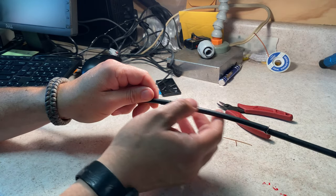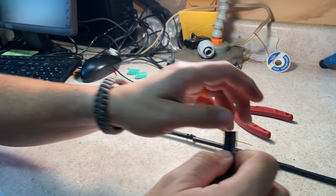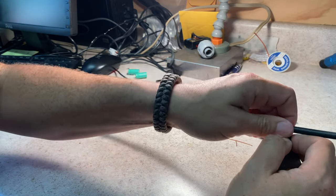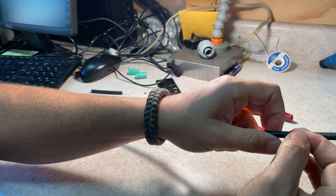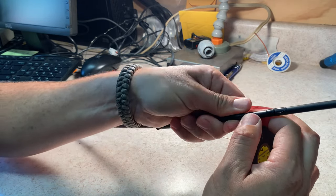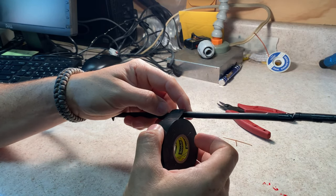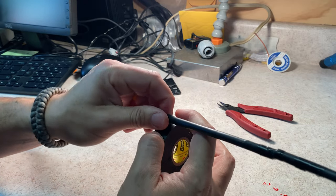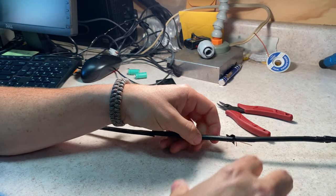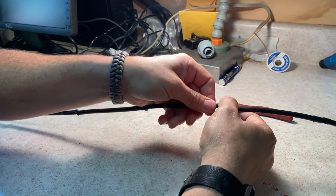And then we have all these bits of electrical tape insulating. So any place where I trimmed wire sticking out of the jacket, I'm going to put a piece of electrical tape on. And then at all these junctions, I'm going to put a piece of electrical tape. This electrical tape at the junctions is not critical for me because this is going to be fed inside of a piece of PVC. So it is going to have weather protection. But you know what? I'm building it now. I have electrical tape with me. So why not simply put a little bit of it on there